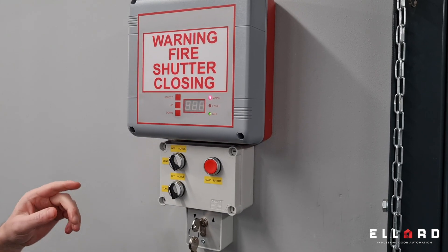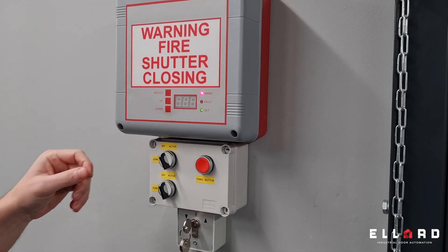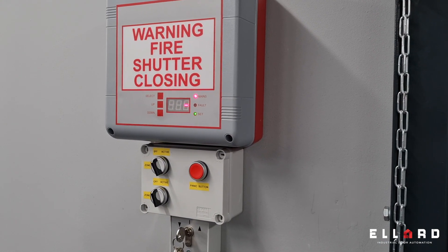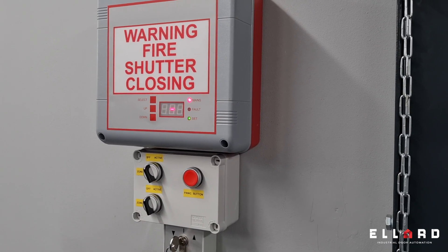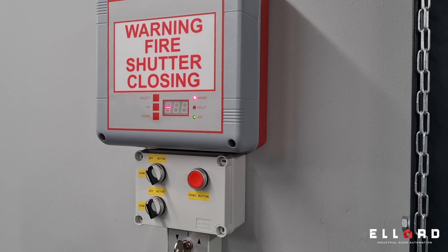The FC-PO3 uses three main settings: Fast Set 1, Fast Set 4, and Fast Set 5. Fast Set 1 is for solenoid drop. Fast Set 4 is for drive down operation, and Fast Set 5 is for two stage closing.